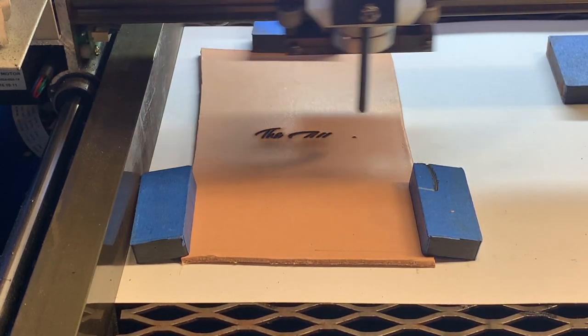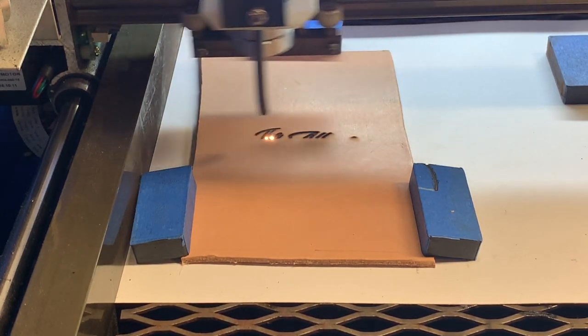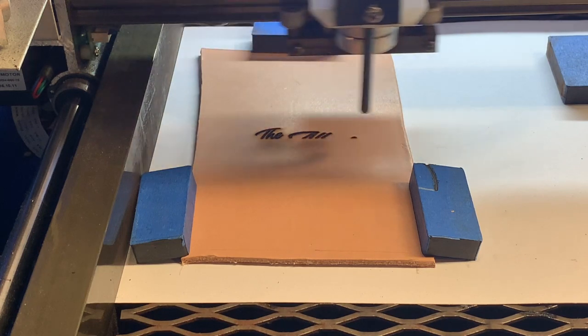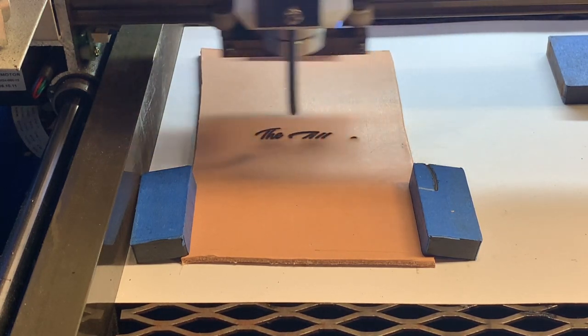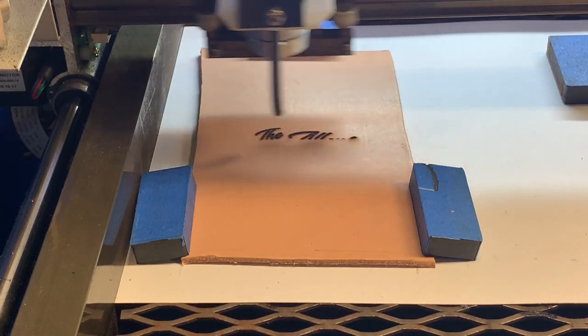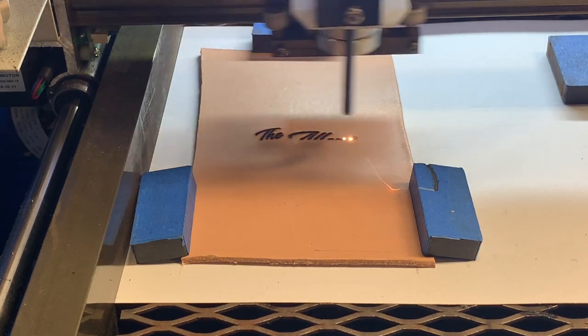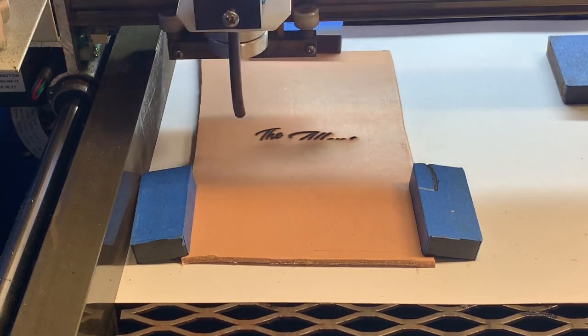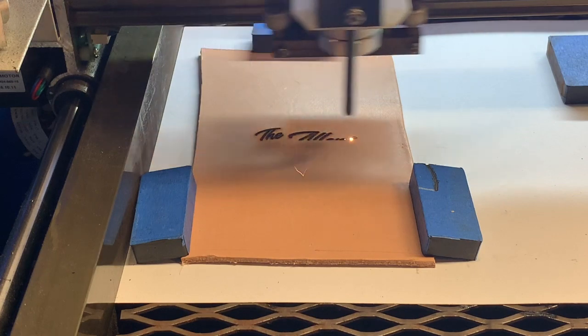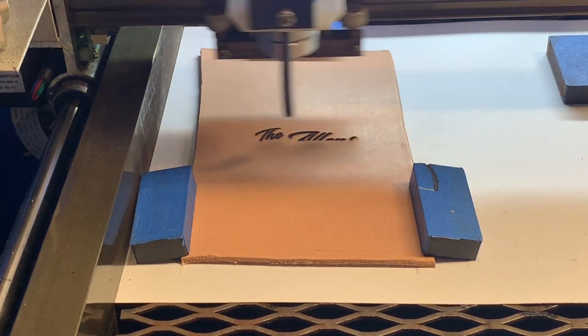Okay, as you can see here this is the laser doing its work. Like I said, we're running it at 250 millimeters per second with about 10 to 15 psi for the air assist. I have just a regular air compressor connected with a valve and a pressure regulator — that was the best solution for me with this K40 laser, as I had done a couple of things to it right out of the box to get it working a little better. We're going to go ahead and speed this up.